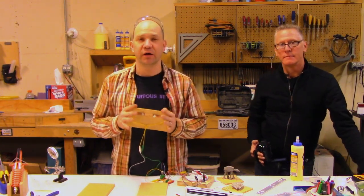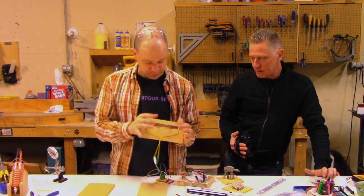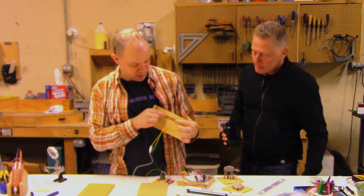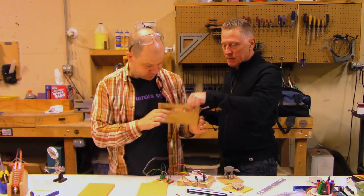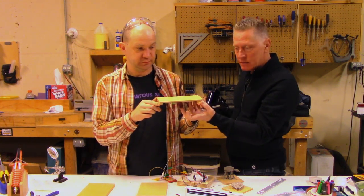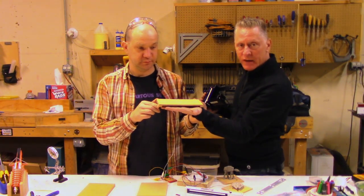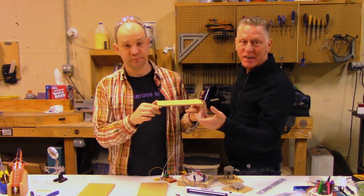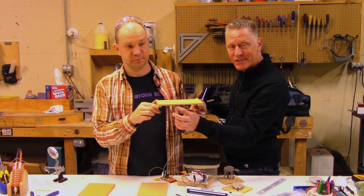If you probably don't have an industrial CNC machine, you don't need one. This is just glue and wires and soldering. We have our leads coming off here — this is just the two-step version — and you should be able to hear the relay going when they're both engaged. As long as this plate is like this so that the magnets hang free under their own weight, the switch is open until the magnet is placed on top. We generally put another plate down here as a protective device to keep somebody from accidentally pulling on it — you can use a piece of acrylic, a quarter inch MDF, cardboard, anything — to keep those pieces in place and keep the magnets from making the little copper strips sag down over time.